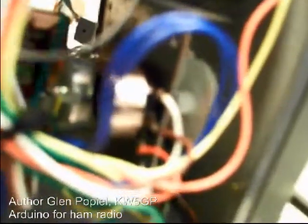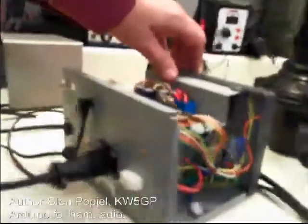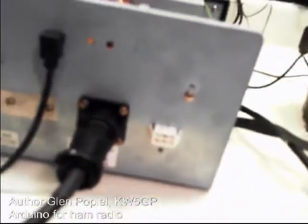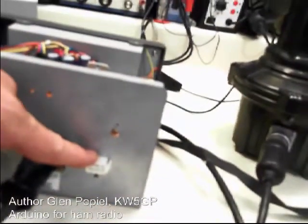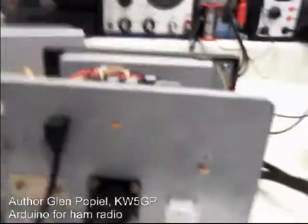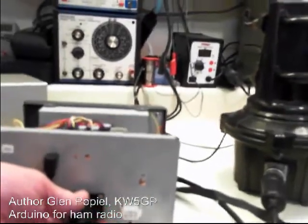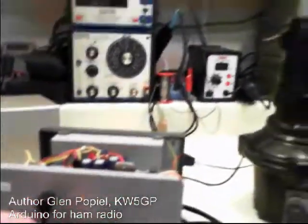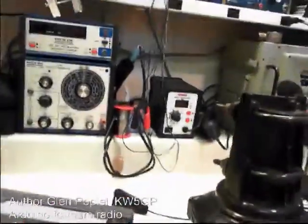And that's what makes these so interesting, because back in there you can see the little geared system and the pots and stuff a little bit over. And you can see our position sensor. We have to tap in off of all of that. And those of you with a Yaesu rotor, I highly recommend doing this. That connector is a pain. It gets loose. It doesn't connect right. It's got these tiny little pins. What I've done, and I'm not going to disconnect it because you lose everything, I have done with a twist lock connector. I've got like a 7-pin twist lock in here. That gives me a firm, solid lock, and I don't care how bad Tom walks across the cables and kicks it with his feet. It's not coming loose.